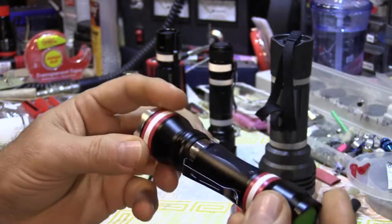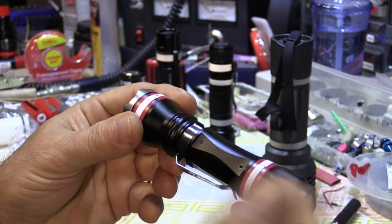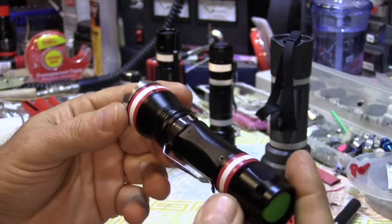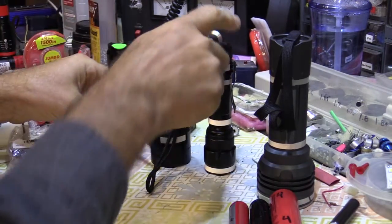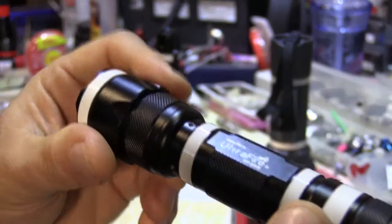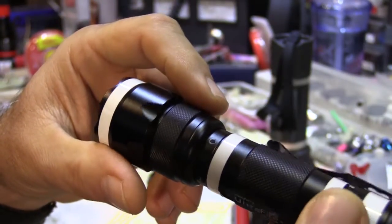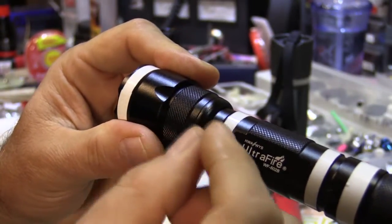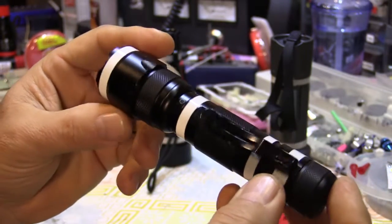That will give the expanding gas a place to come out before the cell does its terminal discharge. There's about a 30 to 60 second window once it's shorted out where gas is piling out along with foam and chemicals — and then it explodes. So in that 30 to 60 seconds, if you smell something funny or see smoke coming out of these holes, get it out of your pocket and throw it as far as you can. On the UltraFire 502B I drilled four holes around a ring, filled them with black marker so they're barely visible, and put scotch tape with a pinprick on the back so a light drizzle is fine.